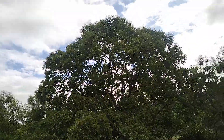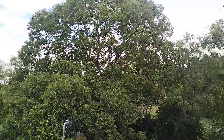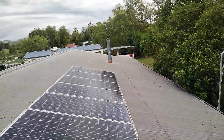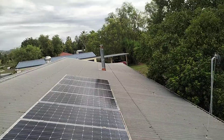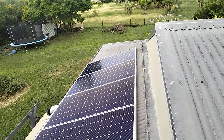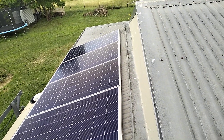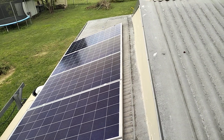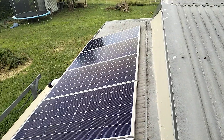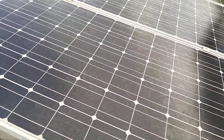There's a big tree, and the sun goes behind that tree at about 3:30, so you get severe shading on the end panels which drops the power down dramatically. Whereas these ones on the northern-facing veranda roof start producing by 7:00 to 7:30am depending on the time of year, and they produce right around to 3:30pm as well, giving you a lot more power.